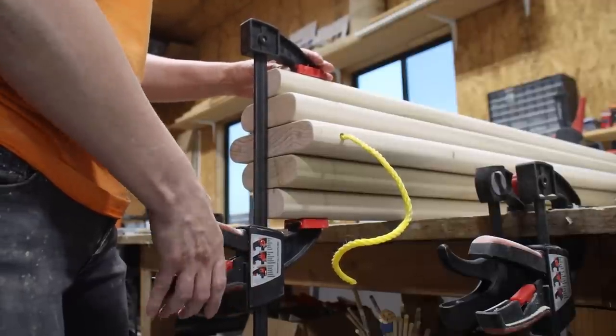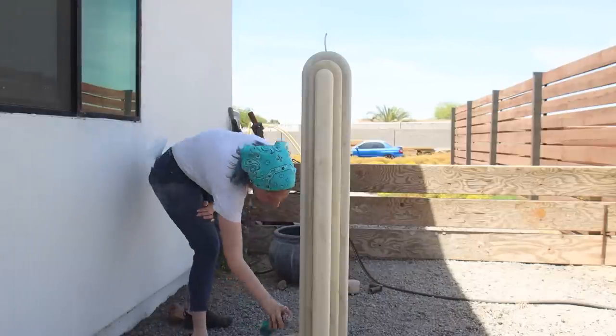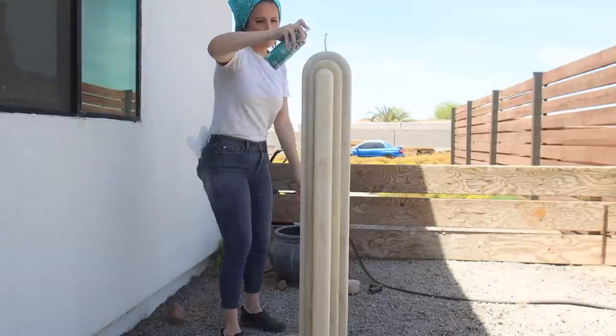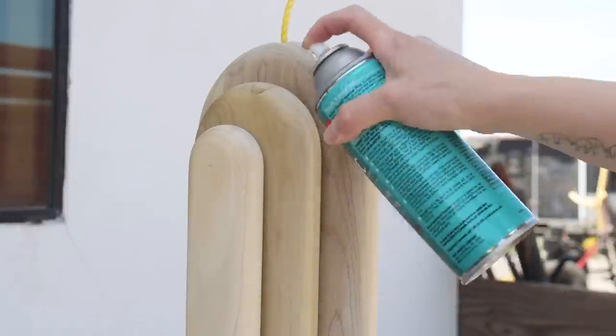Like with most glue-ups I needed to work quickly. I didn't have a ton of flat surface area to clamp the lamp to my workbench, but I was finally able to get everything balanced and get a couple of clamps on the boards to hold them together while they dried. The next morning I took the lamp body outside and prepared it for finish. I really wanted to keep the pale blonde color of the poplar so I chose to go with a water-based finish — three coats of satin polyacrylic.